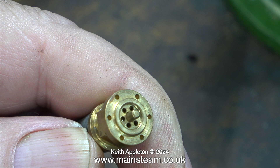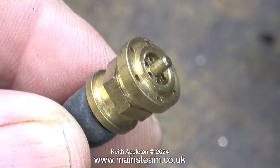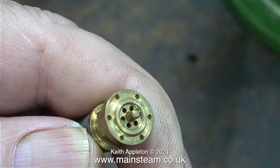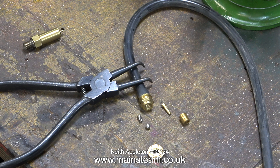I need to set the pressure of this valve because at the moment it's blowing off at far too high a pressure. But before I do that, I'd like to show you how to hold one of these when it's pushed into a piece of silicone rubber carrying air pressure. Do not, under any circumstances, hold the valve by gripping only the silicone rubber, because this would allow the valve to fly off and possibly hit you in the face. Hold it by applying pressure with your fingers to both the safety valve and the silicone rubber, which will hold everything together.